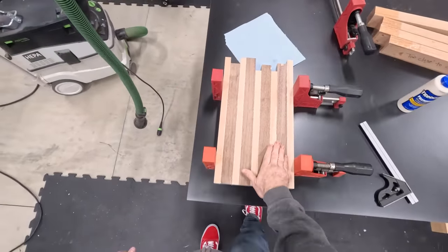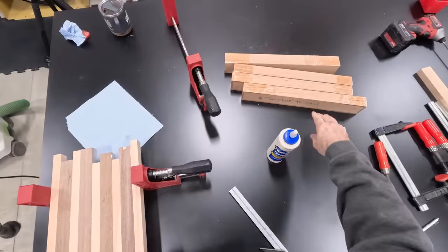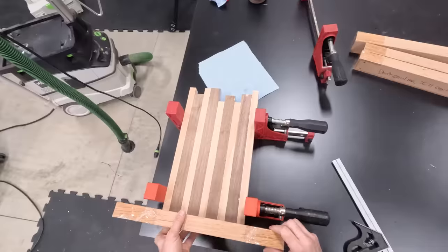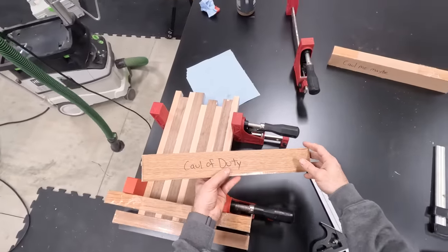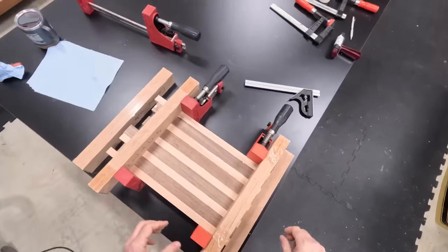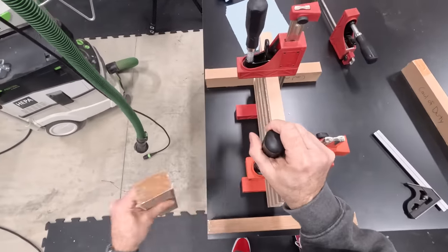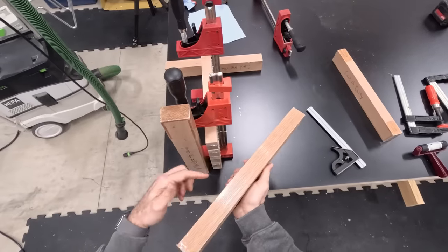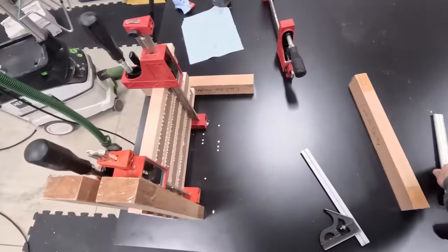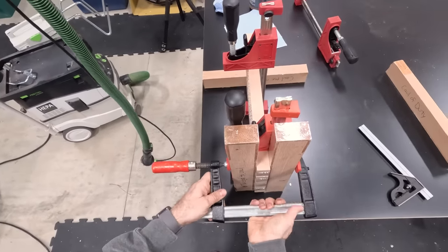How do we make sure everything stays flat? As soon as you start applying clamping pressure, these pieces slip and slide around one another. The best way is with cauls. If you don't have dad-joke cauls, you're really missing out — this one's too close to call, don't call me, call of duty, call me maybe. What we're going to do is place these on both sides. We flip this up, take each one of these cauls — this is just white oak with packing tape — and place the packing tape side against our glue-up. With a good amount of clamping pressure we are going to squeeze the heck out of it.